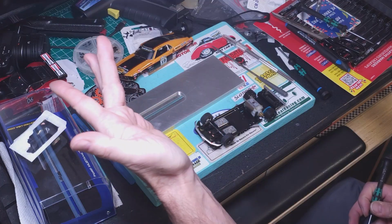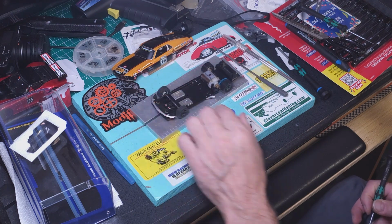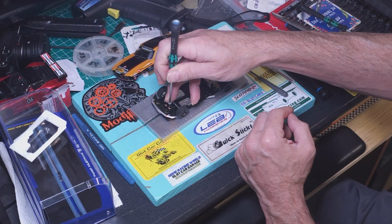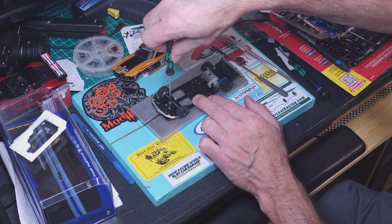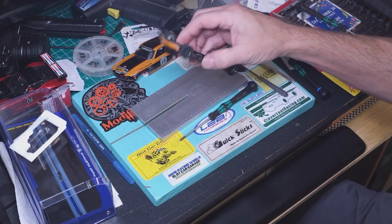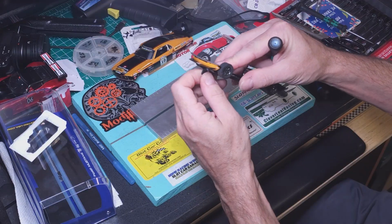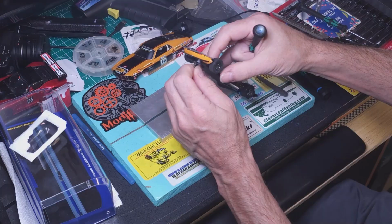You're only going to press the guide and it's going to fall down by, I don't know, what is that, 5 or 6 millimeters? So, you know, start out with it flush. You're going to press against it, and you can see that I've already got it at the height I wanted to. You can notice if I push down, that guide is not coming up any higher. So you want to just be coming in as straight from the top as you can and create those fresh new threads into that plastic. And once you see yourself coming with close, then maybe give it a stop and take a peek and see what you did. All right, well, that's far too tight. That's far too tight. That's pretty good in terms of where I think it'll be, where I don't want slop from the screw. But of course, the more I loosen, eventually I will create slop from the screw.